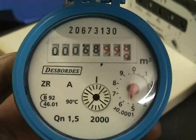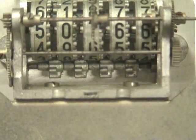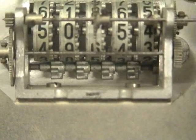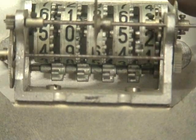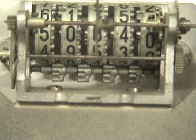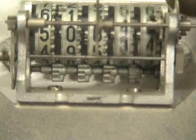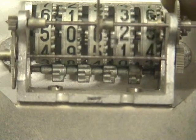Come to the water meter. The Geneva wheel is clearly visible here. See that between the one and the two — there is an indentation. That's the actual takeover pull. That makes the single units operate the tens, and then the tens will operate the hundreds and so on.